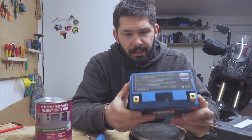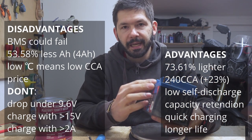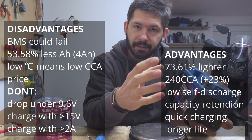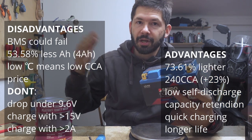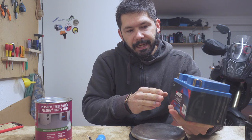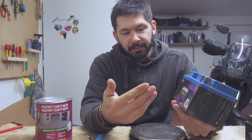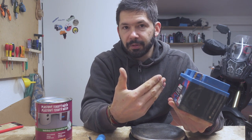Now these have a lot of advantages, but they do have some disadvantages like everything. One of the disadvantages is something called BMS — a battery management system — which is responsible for charging these cells. These are four-cell batteries. The danger for these is overcharging or discharging them under a certain voltage, similar to lead-acid but these are more sensitive to it. Before, in the old days, these batteries had really bad BMS's or didn't have them at all, which leads to the situation called bricking — the cells would eventually die and the battery would give nothing.